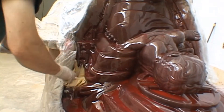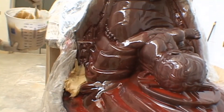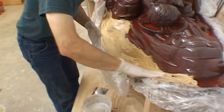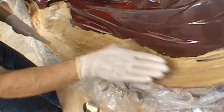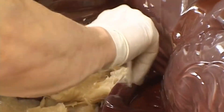The rubber can now be applied with a trowel, working into different areas, filling in detail so that you have no thin sections in the mold rubber. Mix up small batches. After applying a batch of rubber, smooth it out using soapy water, which does not affect the rubber bonding to itself. Work the rubber into all the tight little crevices of the mold.